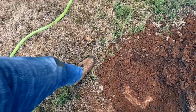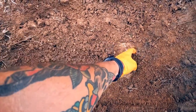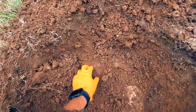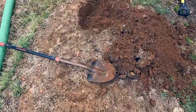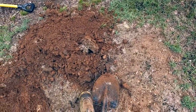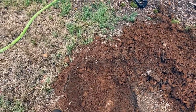You can see where I'm digging — here's where I saw the edge of the tank. I just moved a tad forward and here's the lid. I start digging until I find a seam like this, and then just by looking at it I can tell it's going to be a square lid, so I'll just outline it. Handles right here, so that's going to be in the middle. If you're a homeowner looking for your lids, you don't want to dig right in the middle because you'll just hit tank, and you don't want to dig to the corner either. Look in these spots where the lids generally are — it'll save you a lot of time and frustration.